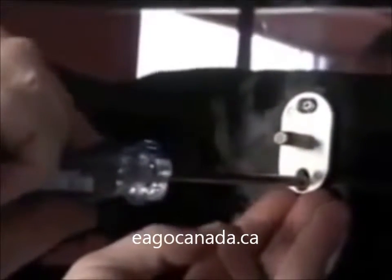What I have here is the screw going through with a rubber gasket, and we're just going to set those through. Make sure that little set screw divot is on the top. Have someone on the other side with the flat washer that's going to go against it and then the nut. Snug that up — you want to make sure you hold that gasket up with your fingers. Snug that up — not too tight because you don't want to damage the glass.